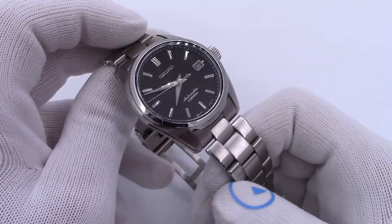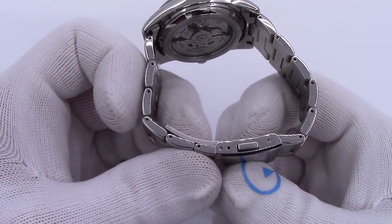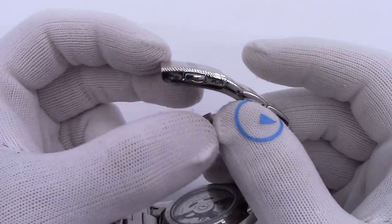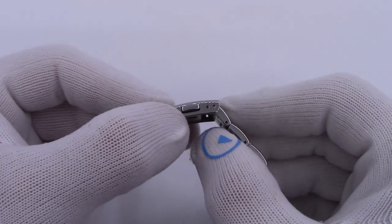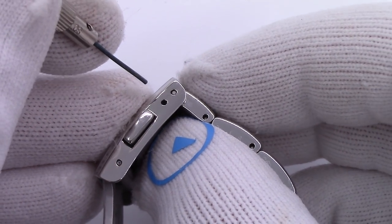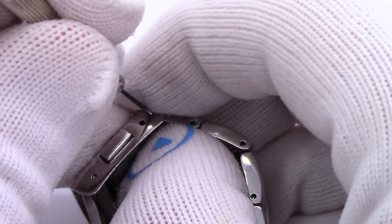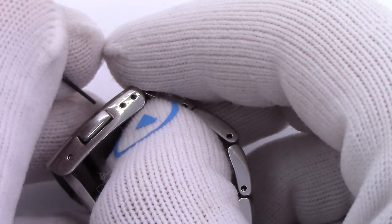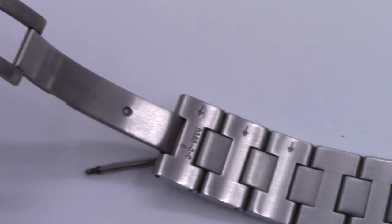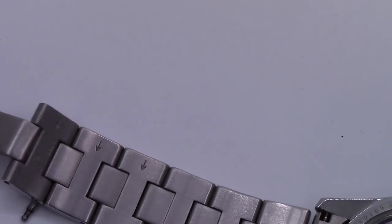If you're going to do your own watch, I always think it's easiest — so the whole thing isn't flopping around — to take advantage of the quick release pin right here. You just take any sharp narrow pin tool and press and push, and it'll release. And now the whole watch opens and you can size it easily without everything flopping around. But let's go over to my little half bracelet and take it from there.